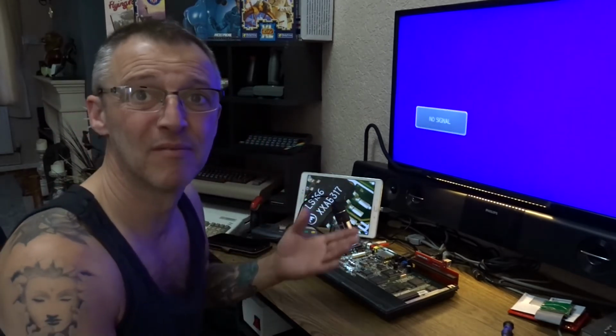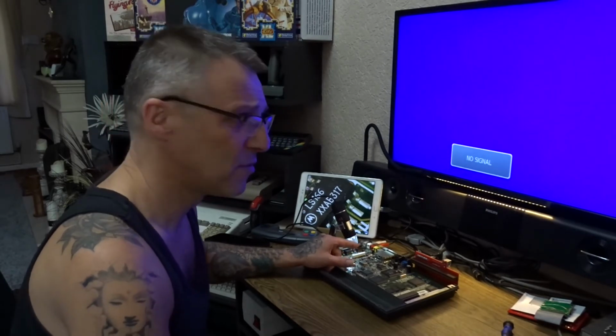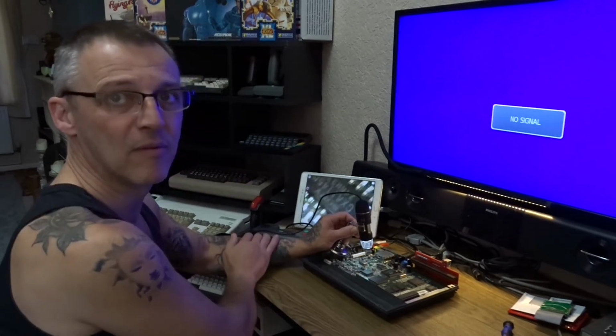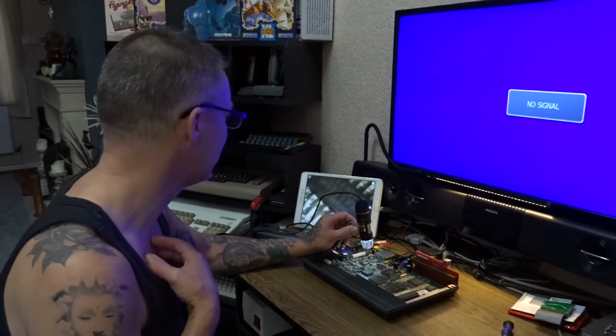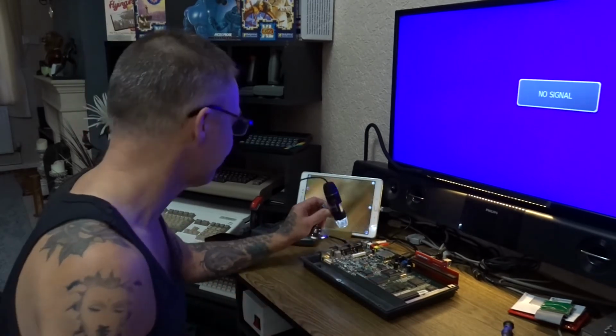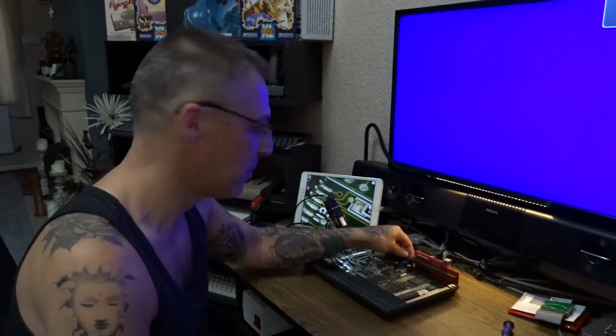I could take it out of the 600, because I'm not really bothered about the 600. But it works, which I haven't done a video on. Well, I have, but I haven't edited it and sorted it. And there's too much of it because of the capacitors, the pads, the traces all disappearing and having to fix all them. So, yeah, another good eBay bargain. Not. I've ordered an encoder chip, which is the CXA1145M. It's an encoder chip. So that's the only place that all three meet. So I'll replace the encoder, see if there's any difference.